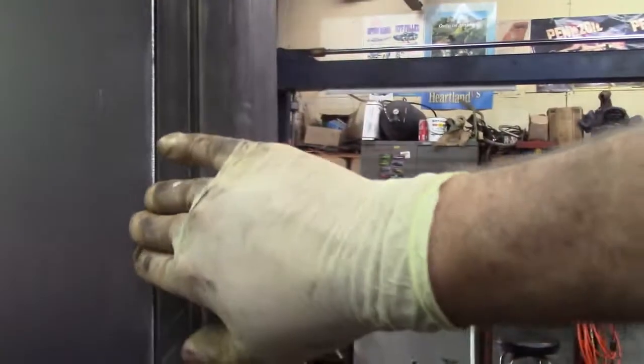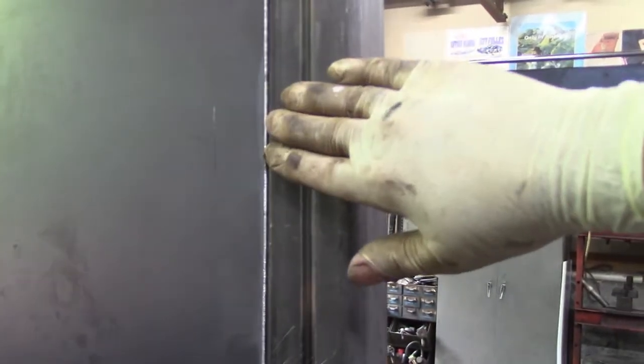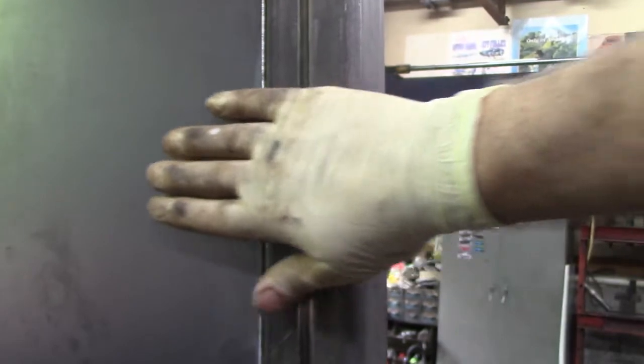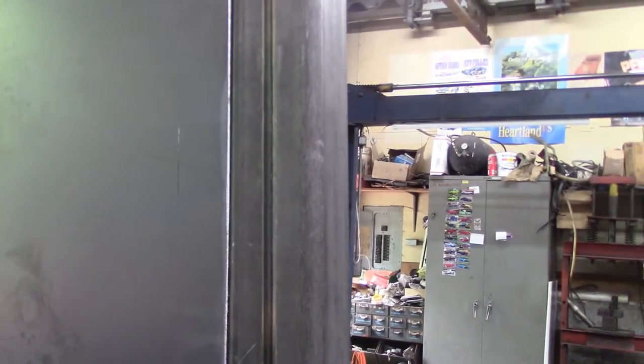And just trying to be fancy, when it's all in position, the inside edge of this tube is going to be perfectly flush with the sheet, so when he's dumping stuff out the back, there's not an edge here for it to hammer on. The way that I sized it, and the offset of all those vertical tubes down the side, is so that they were spaced in the thickness of the sheet.